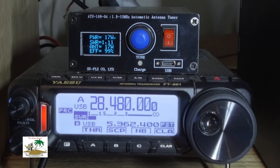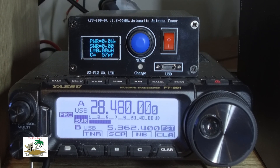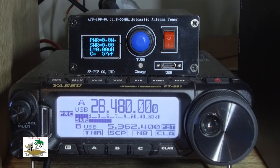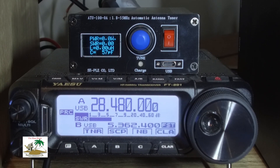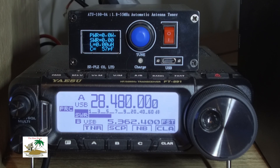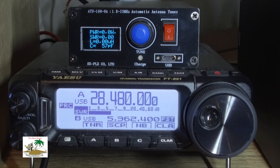The antenna I'm using in this case is a wideband military antenna that covers from 2.5 to about 70 MHz. The SWR is between 1.5 and 3.5, and this little tuner handles it. The tuner's range is generally 3:1 or less, and I generally haven't had a problem.